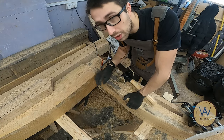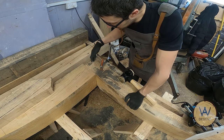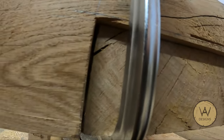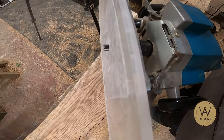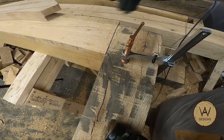Welcome back to part four. Before the new year break, this is where I left off. I have the top beam and the back angled piece — the back corner top beam — all ready to cut the mortise out. But just before I do that, you can see there's a bit that's a quarter of an inch wider than seven inches. So I just need to cut that down with the router bit — it's sticking out a quarter of an inch — and cut off this corner.